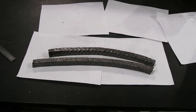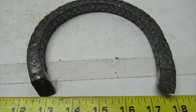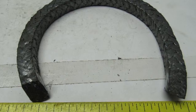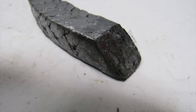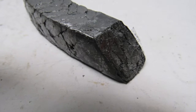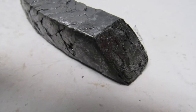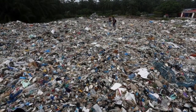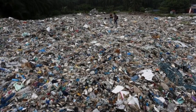Cutting packing will always result in some waste. This could be rings that are too long or short, but also rings whose ends have unraveled or blossomed to the point at which they could result in a leak path. One of the easiest ways to sidestep errors in cutting is to order cut rings from the packing supplier. Besides no scrap, there is also a considerable time savings from not having to cut the rings.